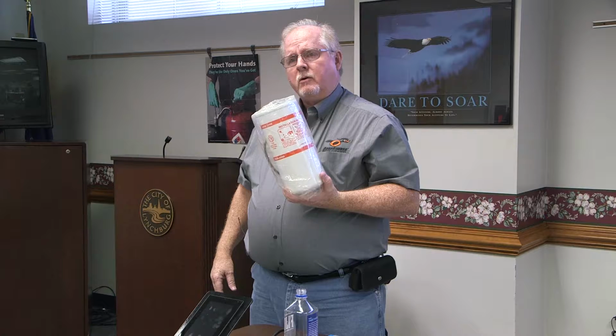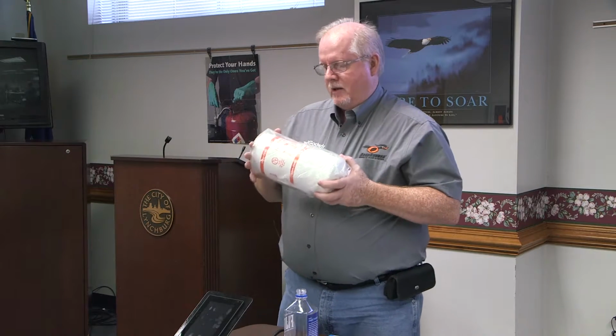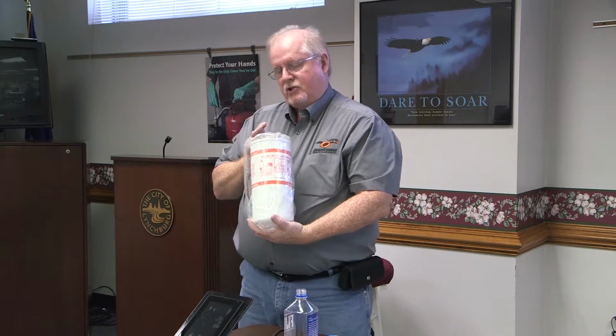I've seen this happen many a time, and it works fairly well. And it's good general hydraulic knowledge that will be useful to you. But these AquaZorb elements, a lot of people didn't realize it, and unless it's changed in recent years, anybody have any idea what the filter media is inside one of these things? Baby diaper.